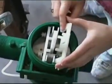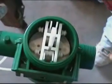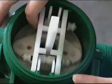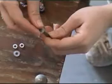Adjust the motor piston so that it aligns across the inlet and outlet, and install the two stops into the slots in the main body. Work the valve arms into the space between the bosses on the stops. Push a spacer washer and a retainer washer onto one end of the actuator pin.